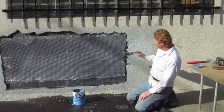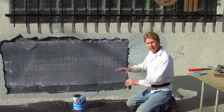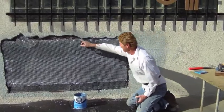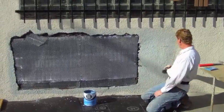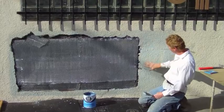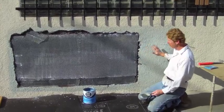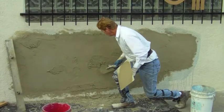I used a 3/4 wire mesh because it's more rigid. With 17-gauge I end up using a lot of mud between the studs. I've applied Weld-Crete over this area because when I stucco it, it's still a little concave — about a quarter inch — but when I'm done I want it true and flush in all directions.